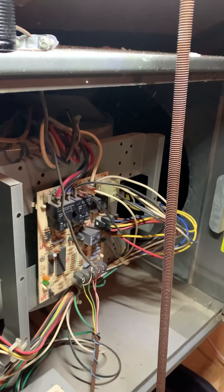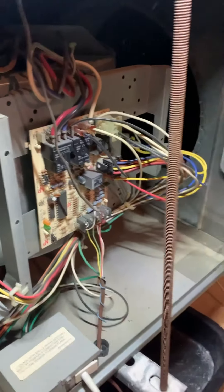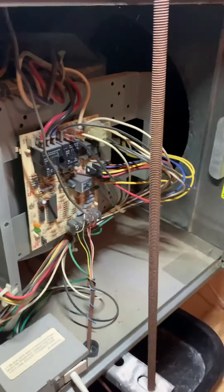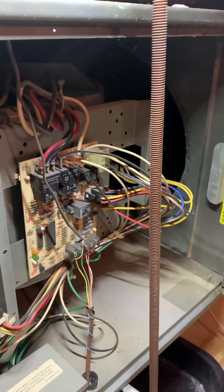I get here, I turn the machine on and it seems like it turns on. I put my gauges on — this is 410A — and the pressure showed me around 90 psi, then 85, then 70, and it was kind of holding there. I went upstairs to check if there was any ice on the coil and make sure the fan was running, because if it's light on refrigerant we can take care of that. And all of a sudden I hear the fan turn back on.